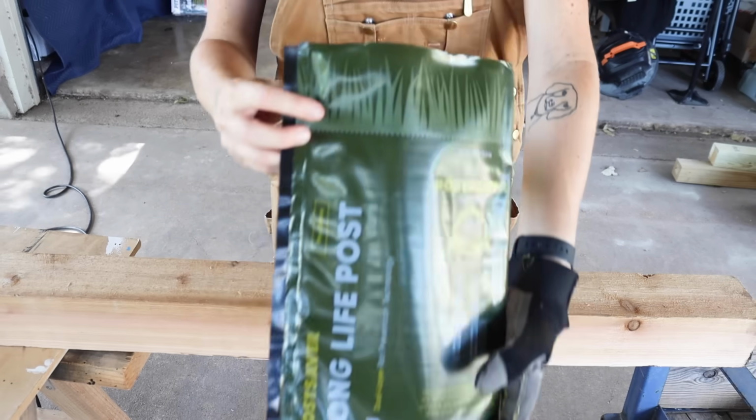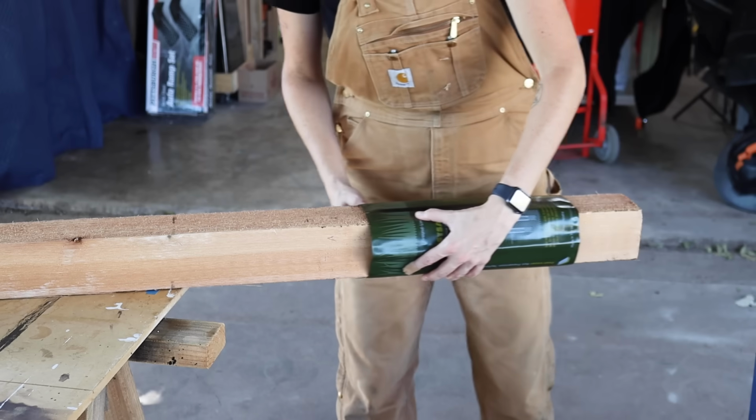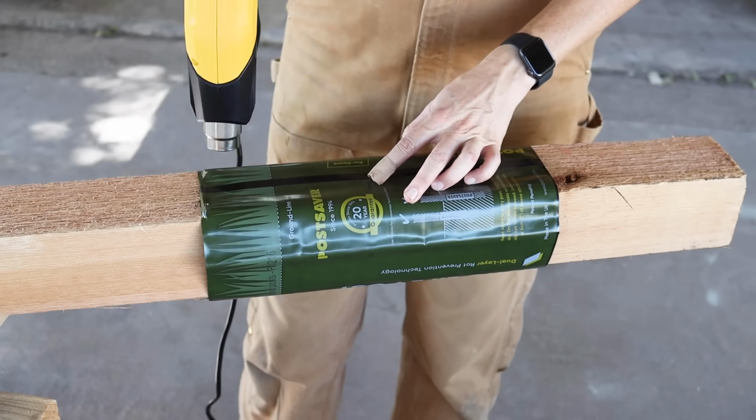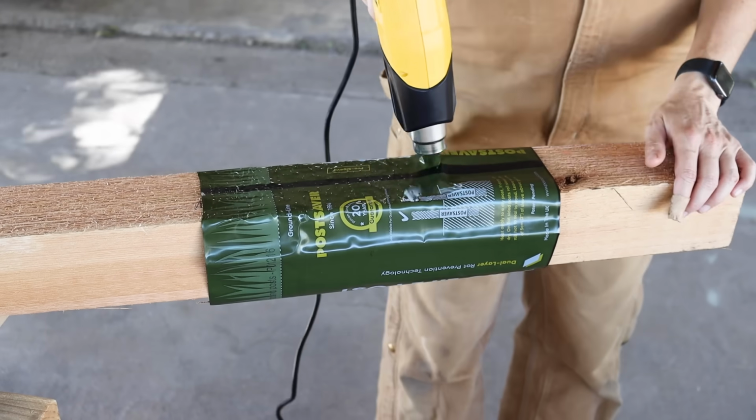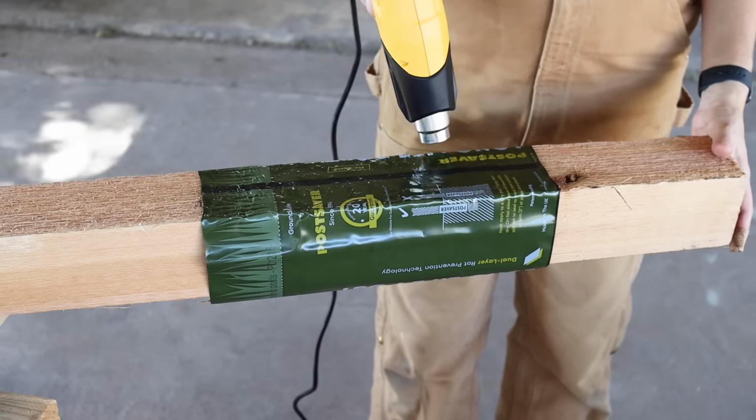They're heat shrinkable sleeves with a tar-like liner that creates a water and airtight seal at the vulnerable ground line. I heated all 4 sides with a heat gun, also rolling each side to really set that inside layer of protection.